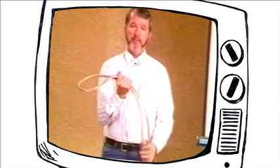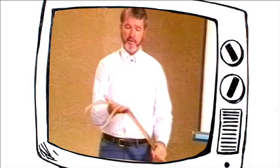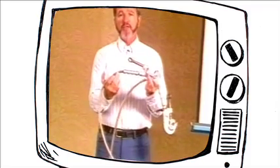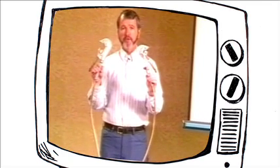Now consider grounding cable. Essentially there are two considerations in selecting cable. Number one is fault current capacity — your cable has to stand the fault current. What we're looking at here is a number two clear-jacketed copper cable. It has a fault current capacity of 12,000 amps for 15 cycles. The other consideration is the interfacing or interconnection between the cable and the clamp itself. It needs to be the lowest possible resistance connection. In this case we have the best of all possible connections: a compressed ferrule, compressed onto the cable, threaded and lock-nutted into the clamp. What we have achieved is the lowest possible resistance from one end of that jumper to the other.